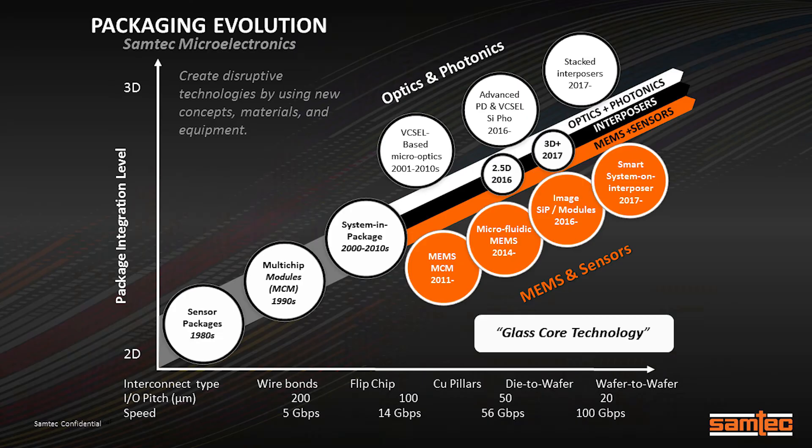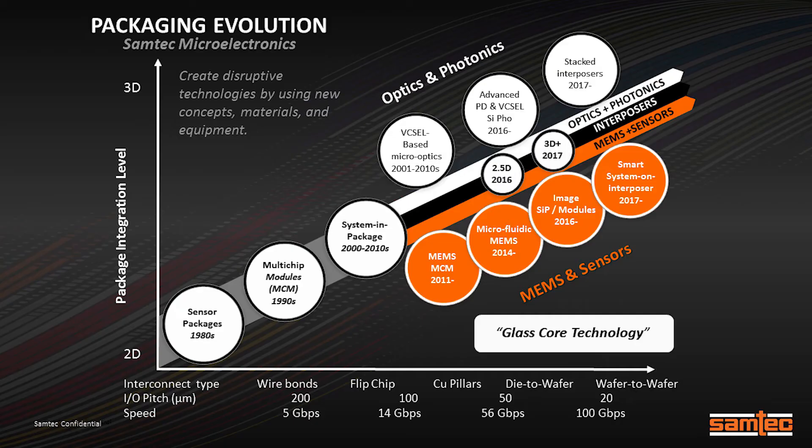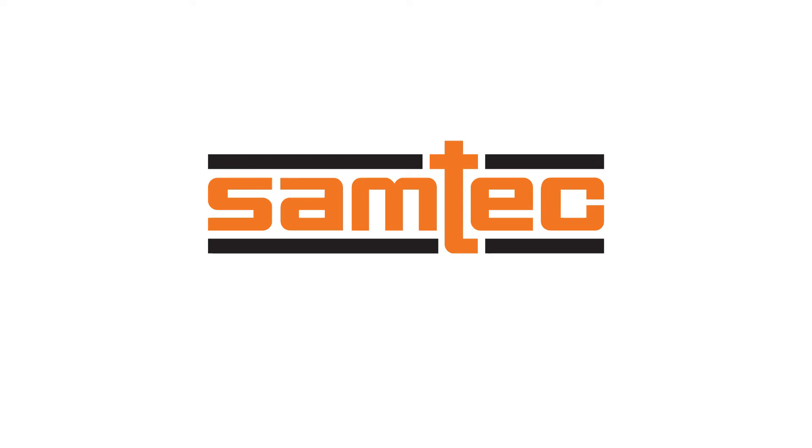We have an upper branch covering optics and photonics. We've used standard VCSELs—vertical cavity surface-emitting lasers—at approximately 800 to 850 nanometers. We'll start to increase that and move into silicon photonics, which can handle an extreme amount of data, particularly for DNA analysis. We made decisions to go from a 2D world toward a 2.5D and 3D solution, and that's important when we start mixing chips.